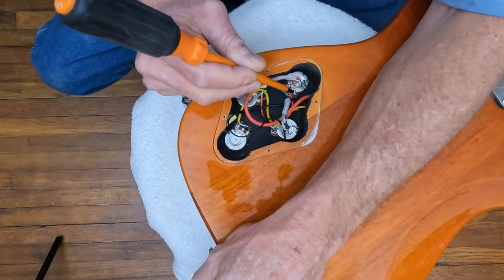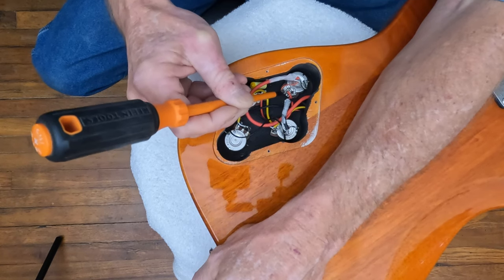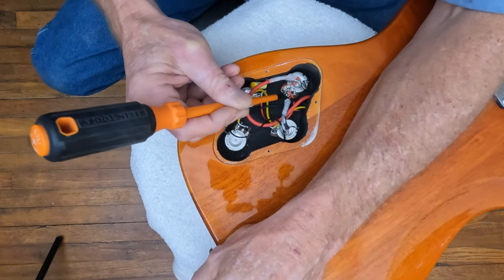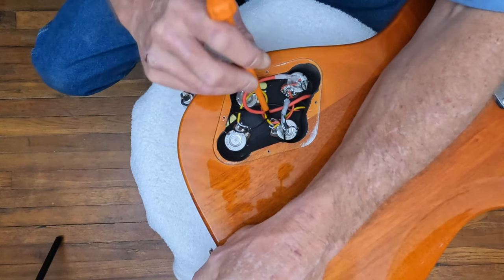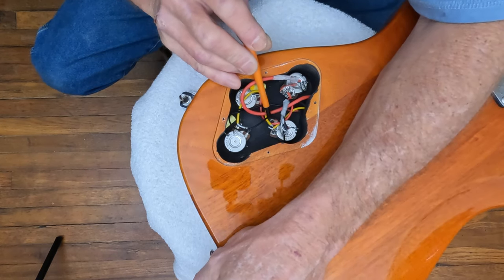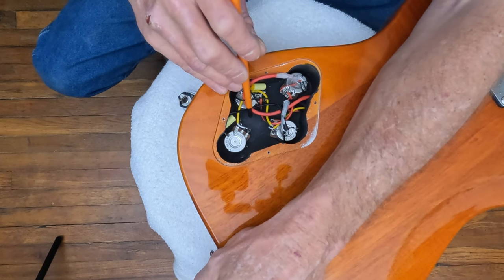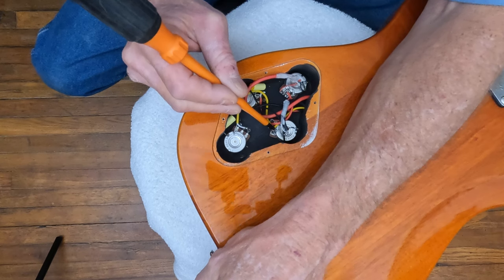Now let's look at our tab here. They did not feed the wire through the hole. So the wire is laid across the terminal and then bonded. Looking at these, they are done the same way. They did not feed the wire through the terminal hole. They're just bonded on the top. I would say the terminal bonds are so-so. They are not great.